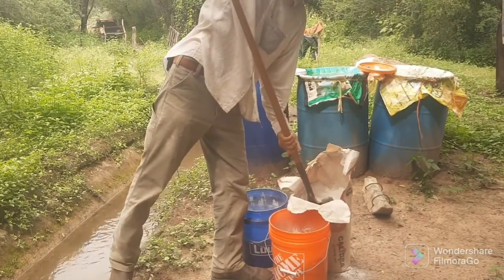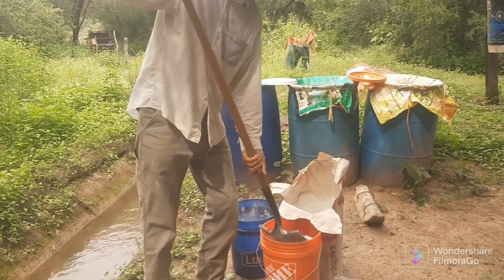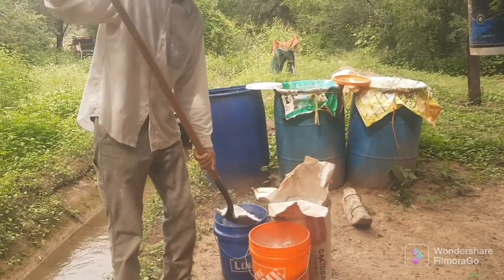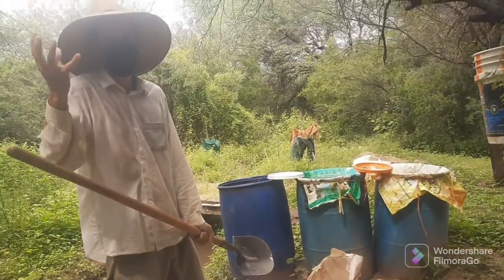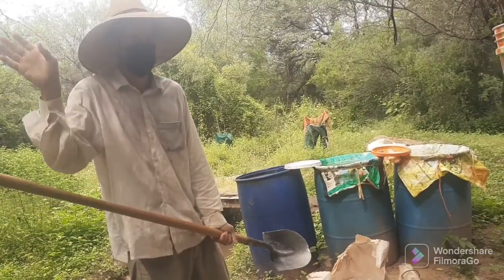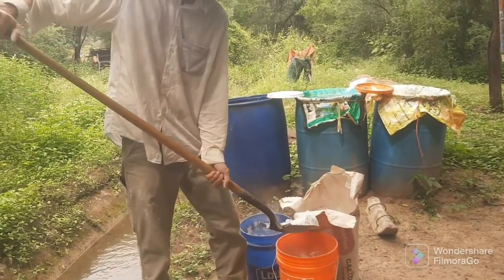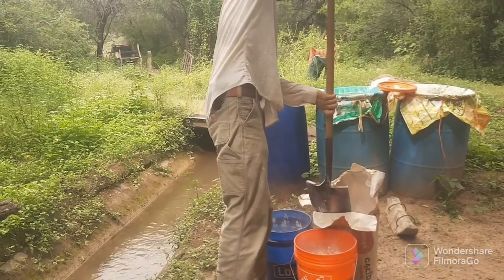We put it in water to make a lime paste and keep it as a paste instead of keeping it in powder. Because it's more stable? Yeah, if you keep it dry like that, it'll absorb ambient moisture and it'll just turn into stone. But if you leave it soaking in water, you can keep it for literally forever. And then you can just get some of the lime putty whenever you need it to make paint or mortar or whatever.